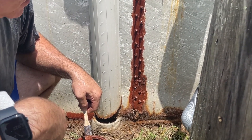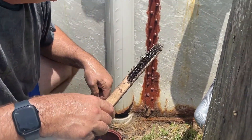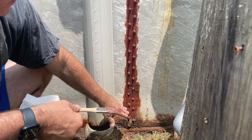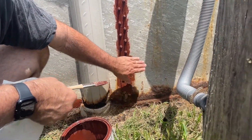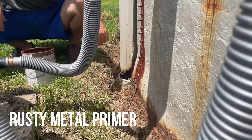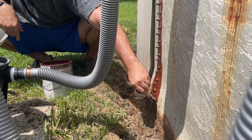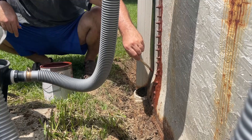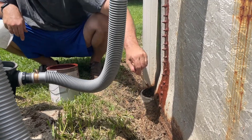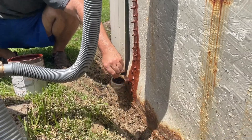What we're doing here: we've got a wire brush and we've scraped and rubbed along the rusty areas. It's real bad right in here — you can actually see it kind of buckling a little bit. We've got some rusty metal primer, which is an oil-based material, and we're just trying to treat the rusty spots and prevent further damage and deterioration.